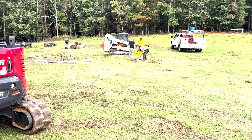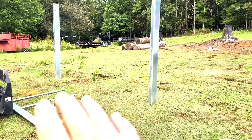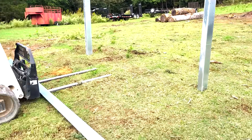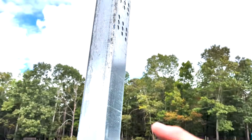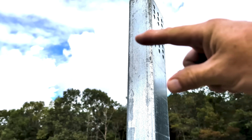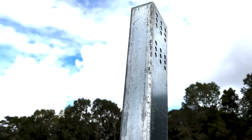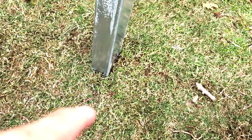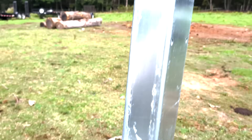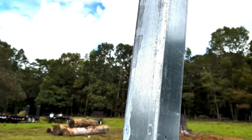Two posts in with a 160-inch span between them, then two purlins. Coming down exactly one foot from the top, we attach the first purlin — that puts the solar panel about four inches above the top of the post. When you're looking at this fence you won't see any steel except for a little bit at the bottom, about 18 inches underneath for weed-eating, lawn mowing, or whatever — and of course a little bit of purlin visible between the panels.